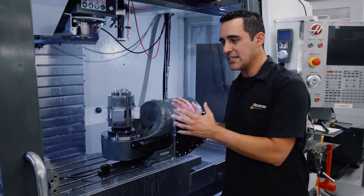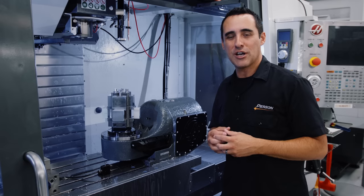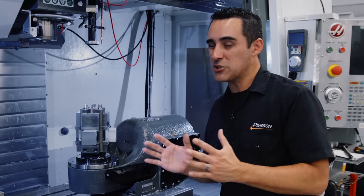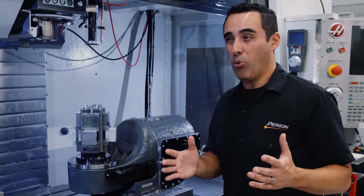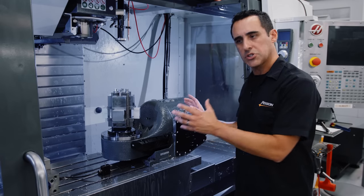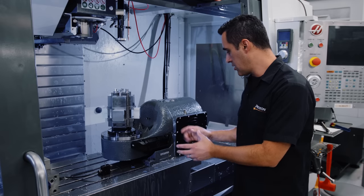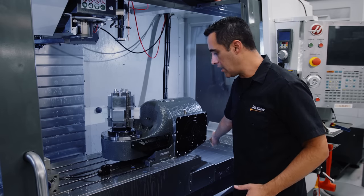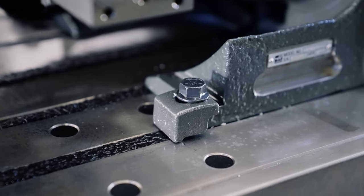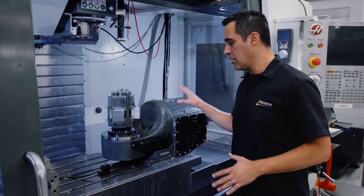I really feel like this setup is the bar-fed lathe version of productivity where you just set it up and it runs, and almost finished parts come out — you're almost printing money without going to jail. The TRT-210 and also its smaller brother, the TRT-160, are bolt-on additions. There's a bolt here that bolts into the center T-slot as well as two outboard outrigger points, plus another bolt in there — four points of location for this unit.